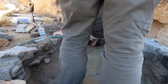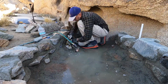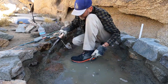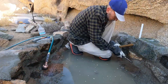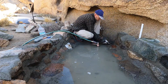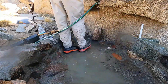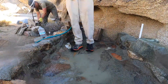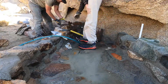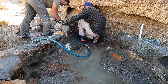One mistake we made was the drain wasn't at the low spot. You can see all this water sitting right in front of my feet there — it was a problem. I wish it would have drained a lot better. So if you're making a hot tub, definitely put the drain in the lowest spot. You can see I use a brush and a dustpan to get the water out, and it still sits with all that cement deposits in there. I'm going to dry stack another layer here.